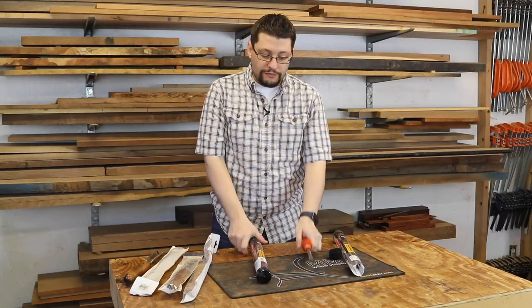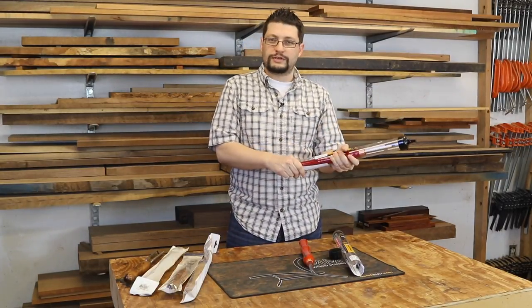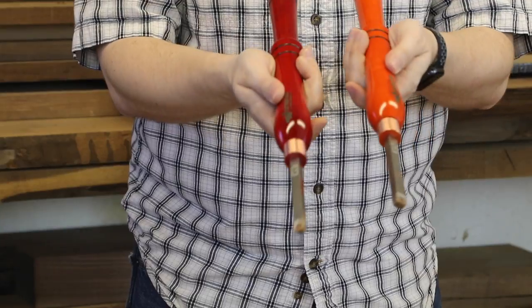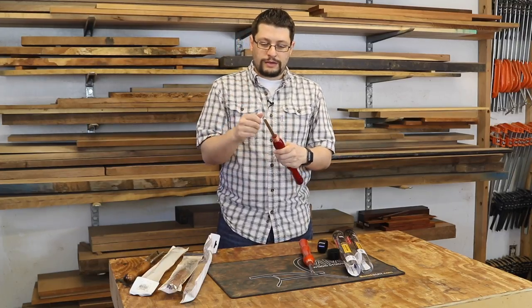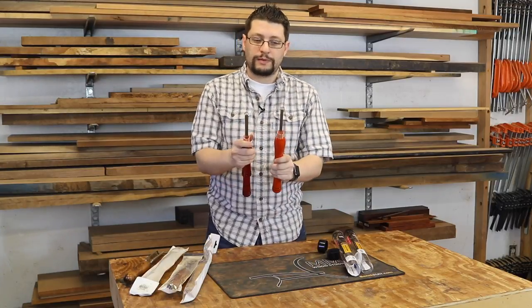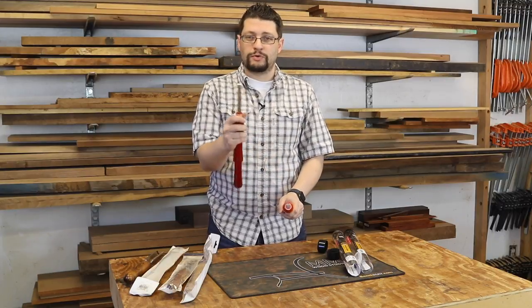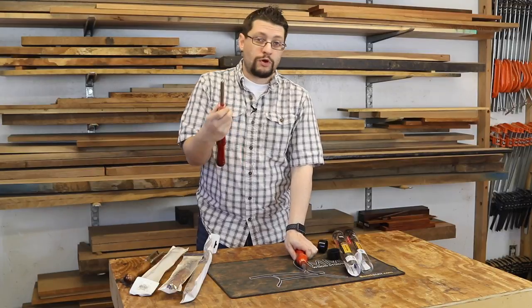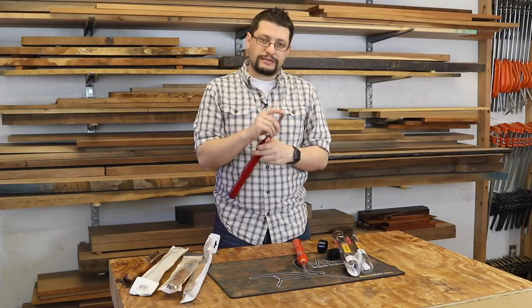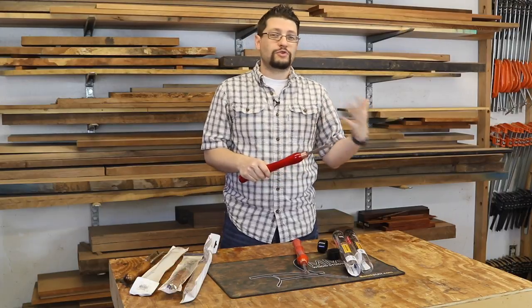What I really love about both of these guys — not just this one, but the rougher with the round tip on it — is that you don't have to sharpen these. You just take an Allen wrench and get that piece of carbide that's right there on the tip for both of them. Rotate it. This guy you get four faces. On this one, you can probably rotate and get maybe three rotations, four if you're lucky, and you're off and running. All you've got to do is buy new carbide tips that they'll mail to you when you order them online. You put them on, and that's it. No sharpening required.